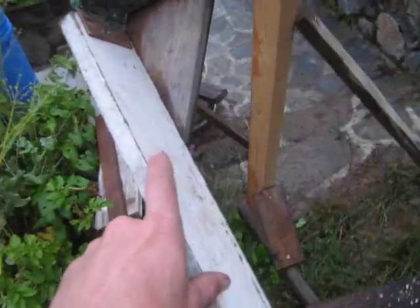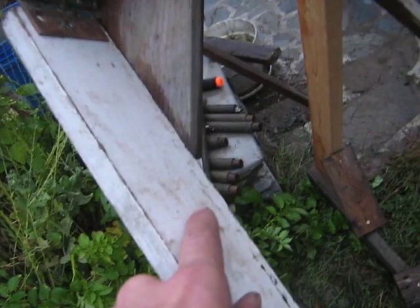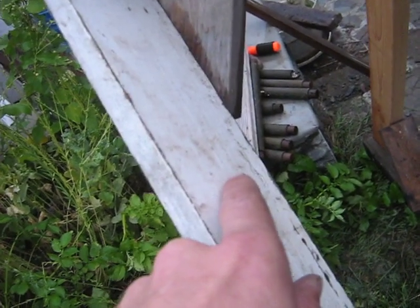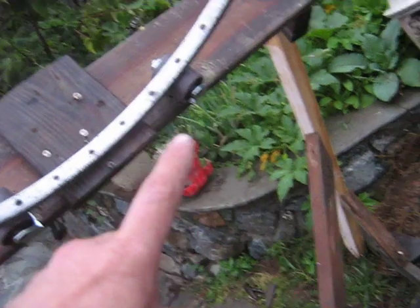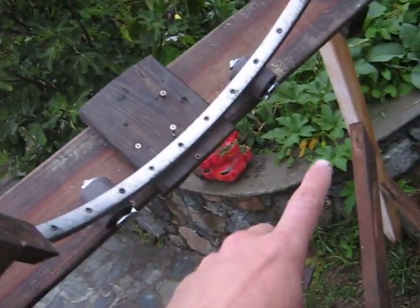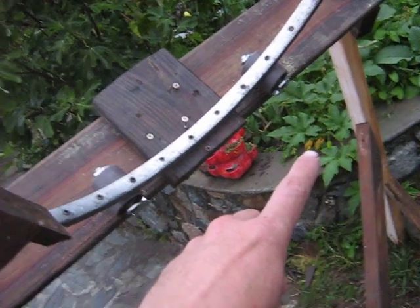Seasonal tracking of the sun is going to be done on an inner frame, which is going to be mounted on an axis that goes through the focal point — from here to over there. The focal point is going to be in the middle of the wheel, about 8 inches, about 20 centimeters back from the middle of the wheel.